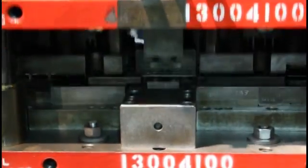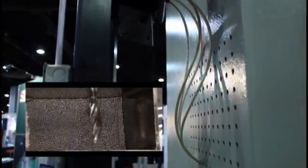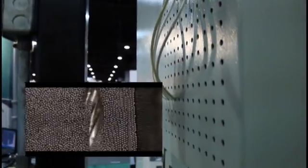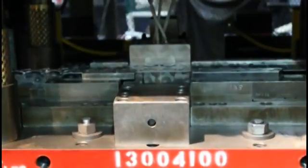But how do the balls get to the die? The balls are loaded from a hopper stationed at the back of the press. From the hopper, the balls travel through flexible tubing to an in-die ball feeder. At the top of each press stroke, four balls at a time are fed into a retractable in-die tray.